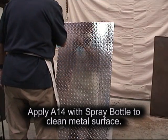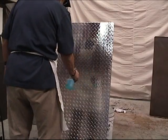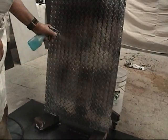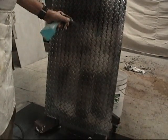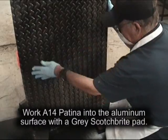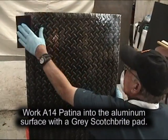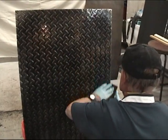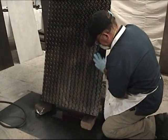If you have a sandblasted surface or a sanded surface, the patina is going to work much, much faster. This alumina black or A14 takes anywhere from 15 to 30 minutes to really take well, and it'll be a little bit splotchy in the beginning, so usually I'll take a gray scotch brite and start to work the patina into the surface. It's slower if you have a shinier surface than if you have a sanded or sandblasted surface.